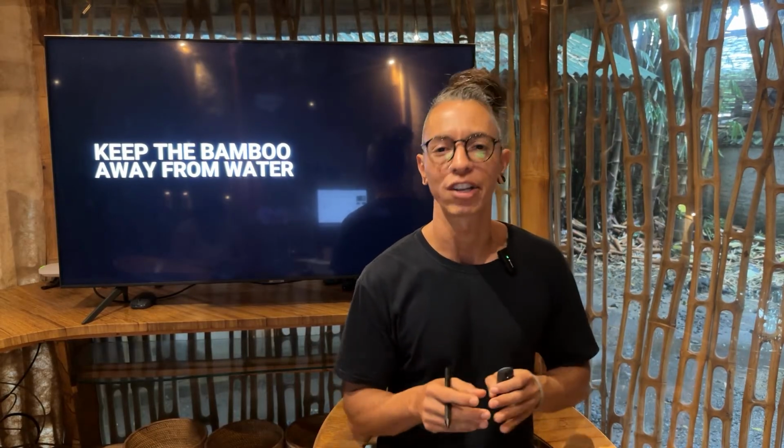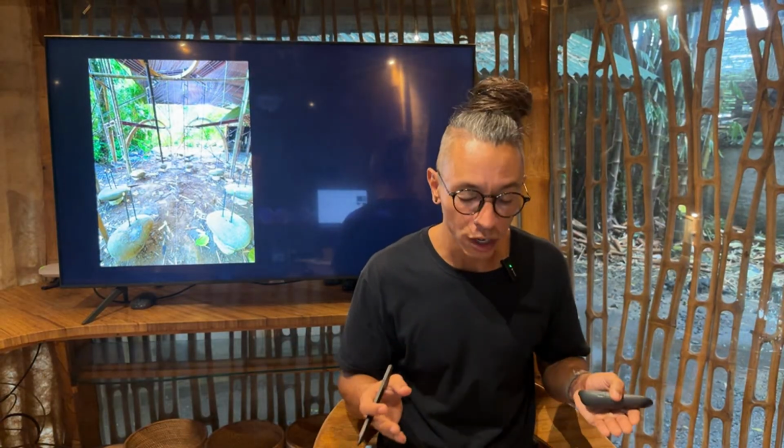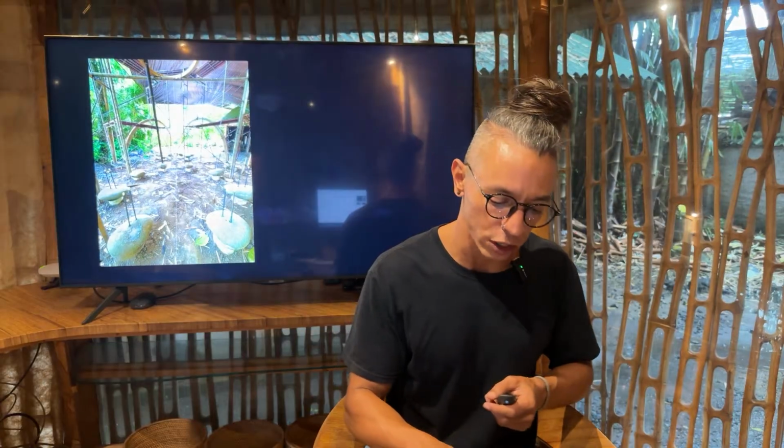But there's a tricky part here. Think about the finish level of your floor. Because you're going to start doing the foundation and you're going to start doing the concrete, the level of the floor and all the layers for the finishing will add on top of that. So that's why you can see some extra space below that we can pour some lime floor or concrete floor there, and then it covers it up. So think about lifting and raising the entire project 15 centimeters at least. You will see many of our projects that we have even more, almost like 30 centimeters, 40, 50, 60. By raising that above the ground, you will be safe in terms of moisture.